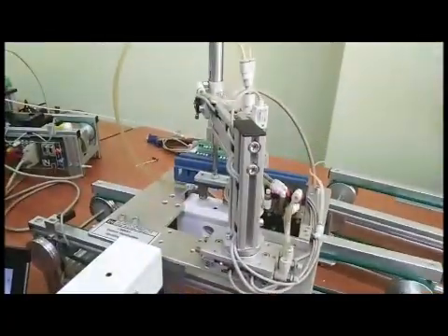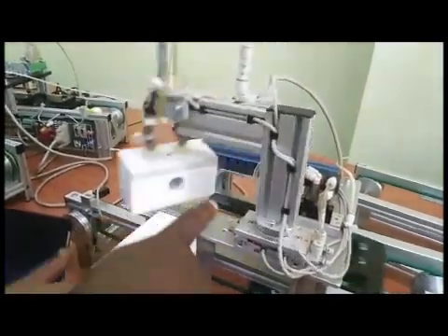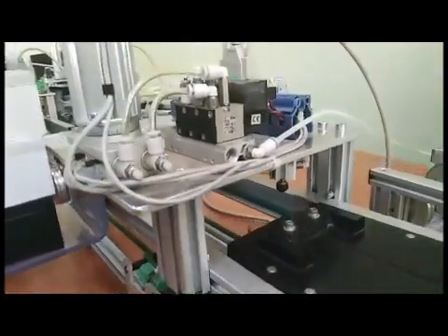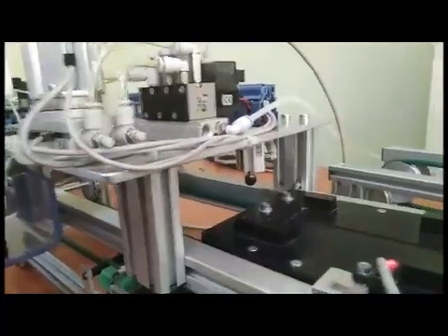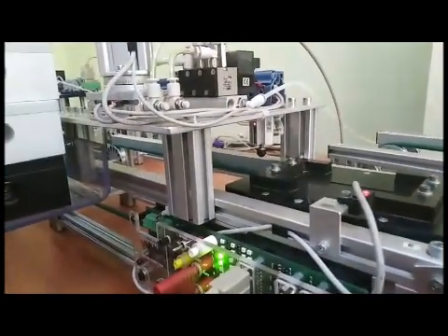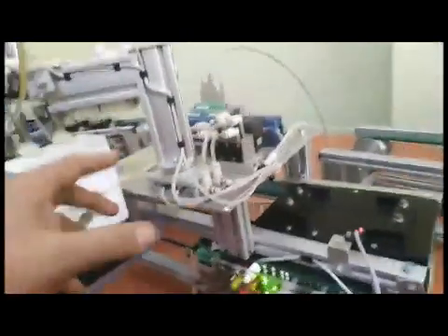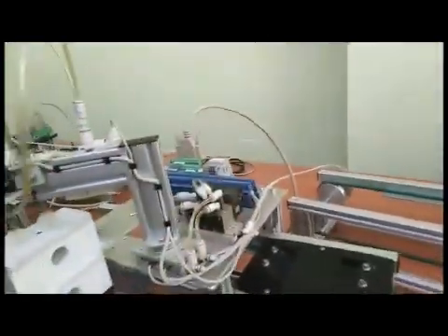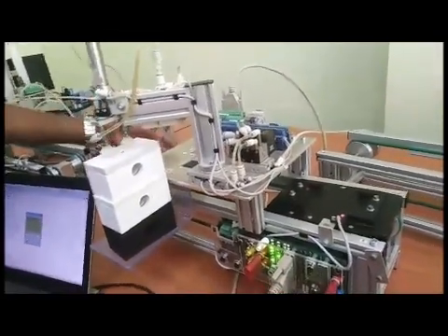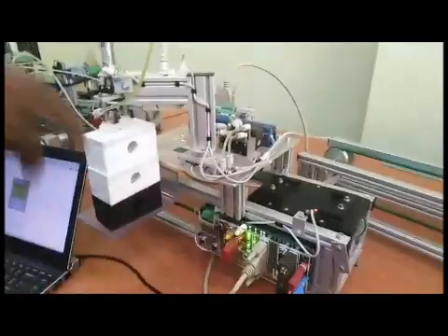For the second unit, there is the sensor for dropping the package. This system here — these are small cylinders, like a barrier. The purpose of this cylinder is to stop the workpiece carrier, so that it is in a position where the robot can handle the material from the production system — to stop it here so that it can be processed. If the stop cylinder wasn't there, it could have movement without control.